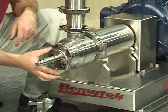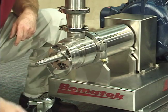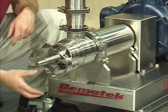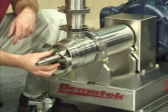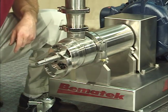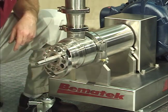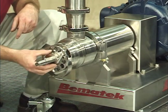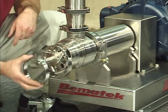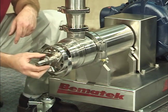The dummy stator and stator spacers hang from the shaft when a stage is removed, and they must be held in position as the front connector is slid into place. For this demonstration we are replacing two stages with dummy components. The total amount of work done on the product increases as the number of shear zones is increased.